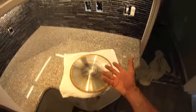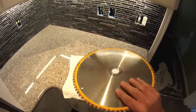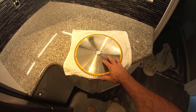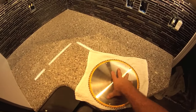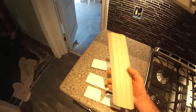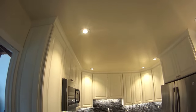It finally dawned on me: make your cheat sheets and get a new blade, because you always want a super sharp blade. This 88-tooth blade was fantastic back in the day, but it's got a lot of hours on it. It's carbide-tipped, but it's gone through nails and a lot of crappy wood. So I bit the bullet and spent 80 bucks on a nice 88-tooth Diablo blade, and that made all the difference. It went through without any wandering and all my angles came out right. So there are your lessons: cheat sheets, a sharp blade, and pay attention.